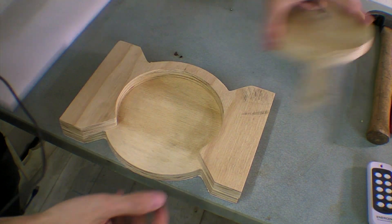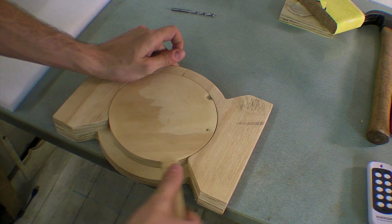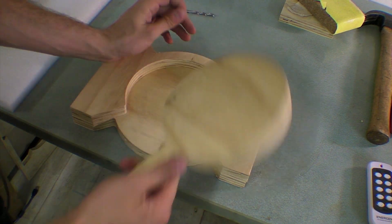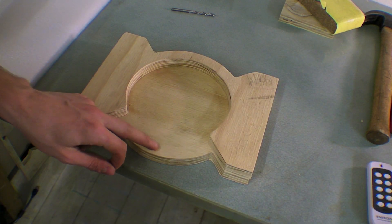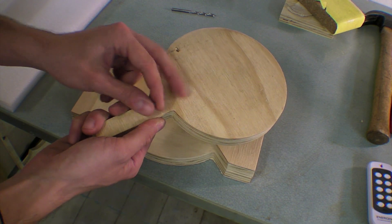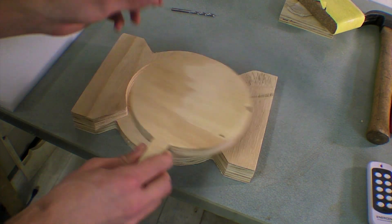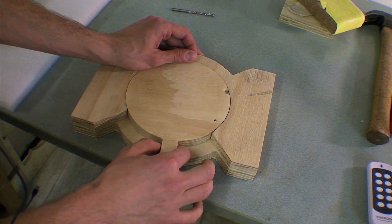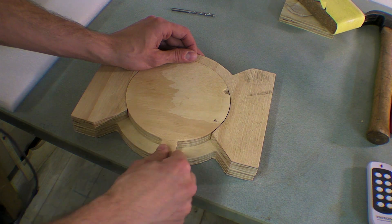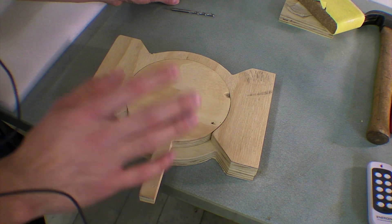I've been wondering whether I can put something in place that could provide a positive lock at certain angles. What I'm thinking of doing is using a ball bearing — this one is about 4.7mm, taken out of a drawer slide. I'm going to drill a shallow hole on the base and a slightly deeper one on the turning component. The idea is to pop the bearing inside with maybe a spring behind, so that moving it across will allow the bearing to lift up, and when it reaches the hole it drops in. I could easily do this on a CNC machine next time round, but this time I'm just going to drill a hole.